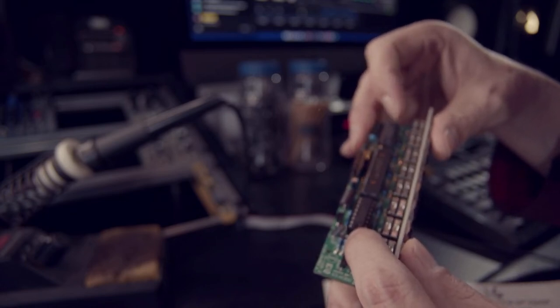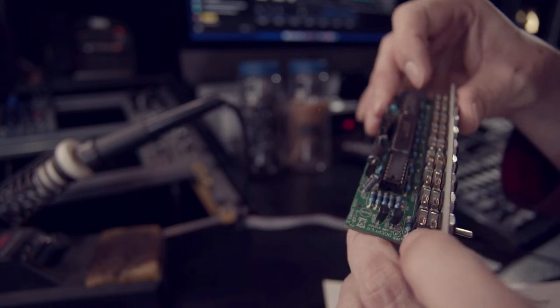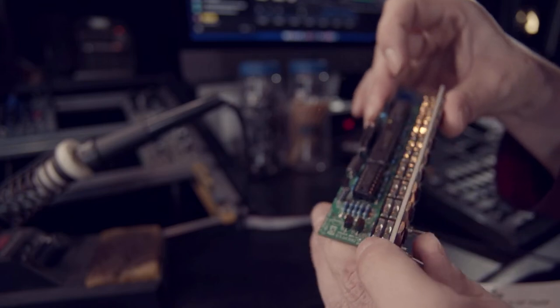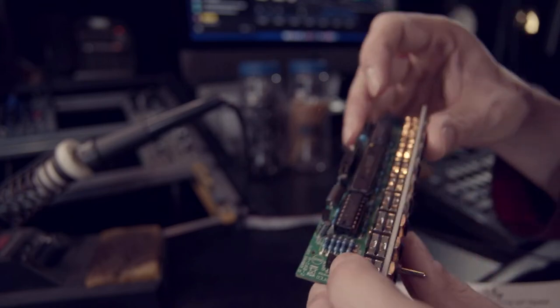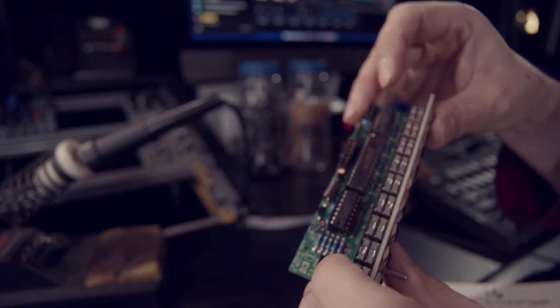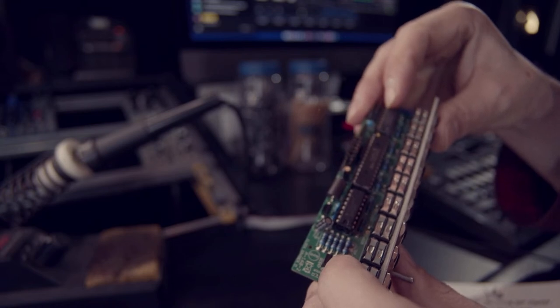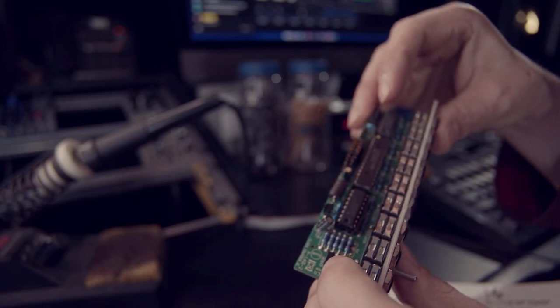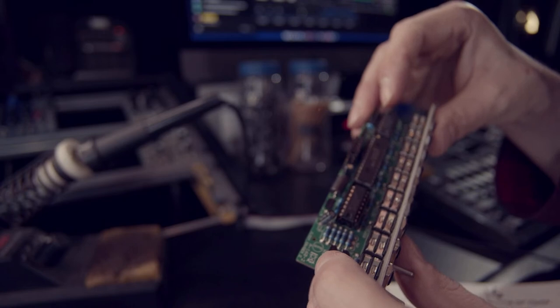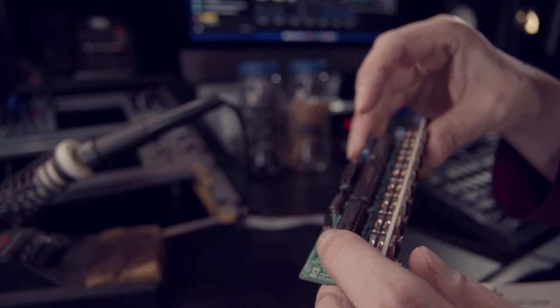Now when it says CD, that means this is a CMOS chip, which means it takes certain voltages and things to do its thing. 4504, I'm not honestly sure what that is. BE means buffered outputs. UBE means unbuffered outputs. For our tube sound fuzz thing, we're going to be using a UBE. We're going to be using unbuffered outputs.